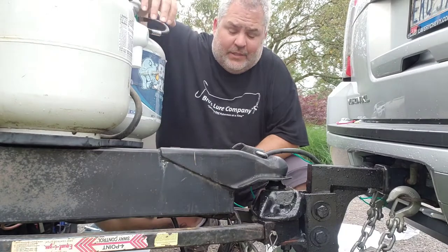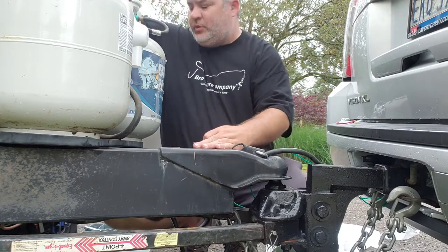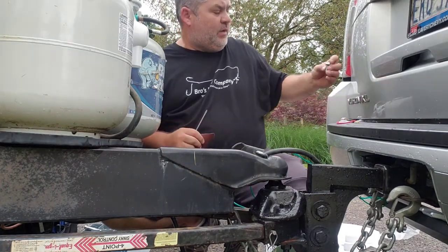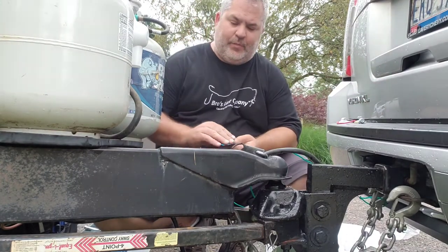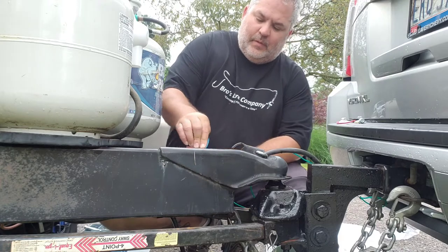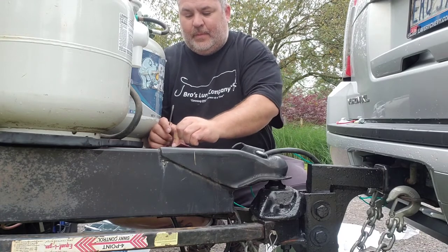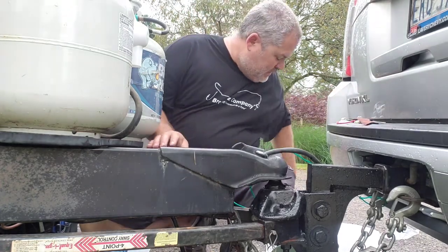Since the jack is internally grounded, I made a little piece of emery cloth here. I'm going to rough up where the grounding washers are going to go, and I want to pull this one off that I showed you earlier. I have to do some small bit of wiring, but first I just want to remove the rust here so I get a good contact surface. The star washers will help dig into the paint, but I'm just giving them a little extra help. All right, that's done.